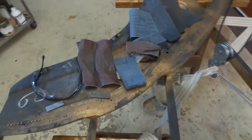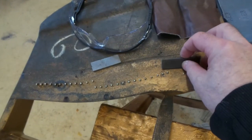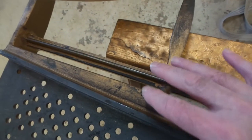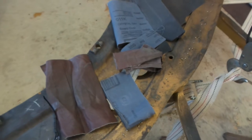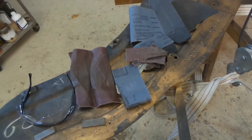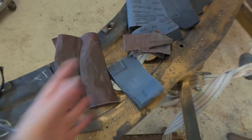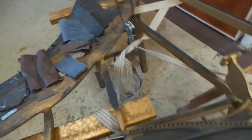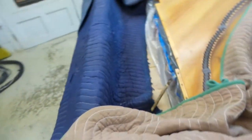It's a pretty simple procedure. There's not a lot of grooving — this is minimal grooving — so just lightly with some files to keep the shape, and then buff it up with various pieces of crocus cloth. This is fine crocus cloth.